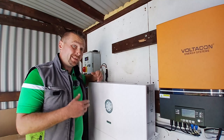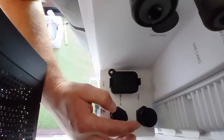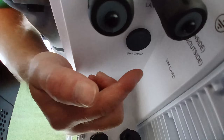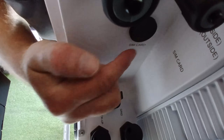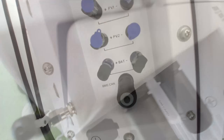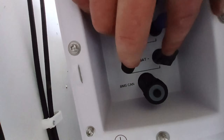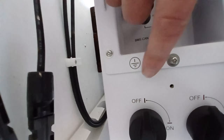The next stage is the fun part — getting it all wired up and everything connected. With the covers removed, we can get a better look at the connectivity options, and it has loads of them. That's your grid connection there, comms port right here, local area network here, earthing point up there — very important. But this can even take a SIM card, and it has its own connection for a 4G antenna as well as the Wi-Fi antenna. The other side has your solar panel connections, which are standard MC4s for the two MPPT controllers. There's also an additional external battery connection and the battery management bus connection, as well as another earthing point.